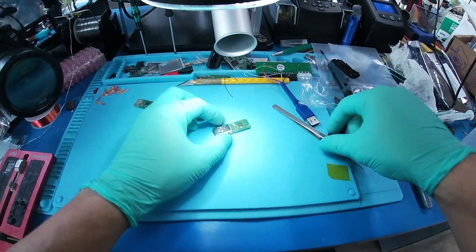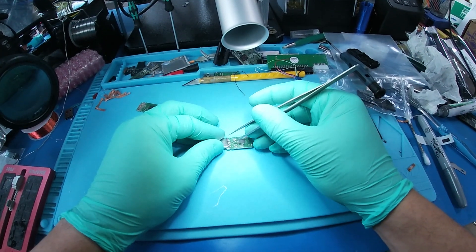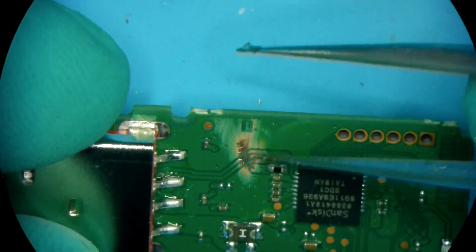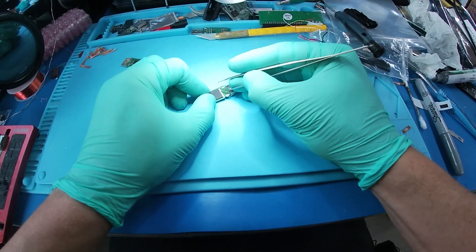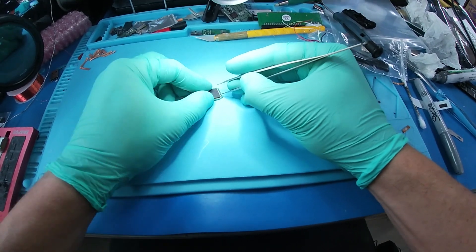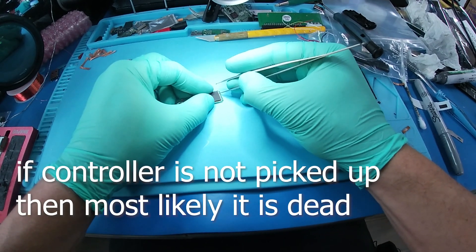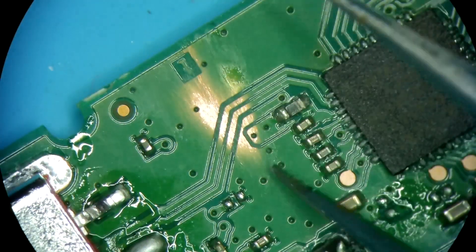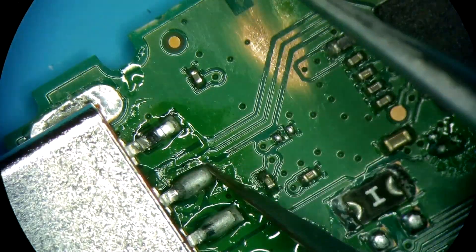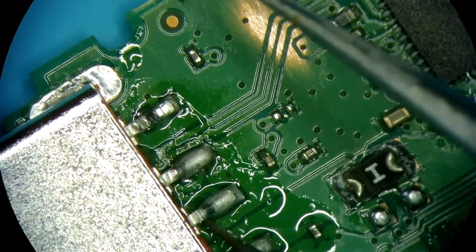It's a totally dead flash drive — it blinks, but aside from that it doesn't do much else. These seem to be attached and in place, they are all making contact, but the SanDisk is not even getting the device recognized. The board is probably still good, but whatever was done to it in the previous attempts to be repaired could have damaged the controller.